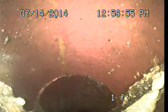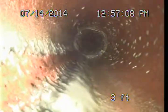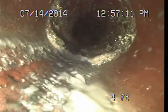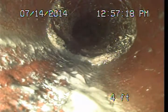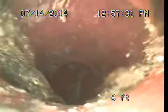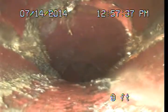Now, these clay pipe materials, they're very common for main sewer line systems. And this would also be an original pipe. This was not upgraded when the structure was remodeled. That being said, if a line's in reasonable shape, no reason to start changing it. But it is an older system and does require maintenance. You see we've got root intrusions at some of the joints or connections in this older clay pipe. That's pretty common in the older clay pipes, and normally root intrusions at the joint areas we're suggesting can be maintained. Regular sewer line cleanings are recommended, because when they're left unmaintained for extended periods, they can create blockages in a system, also potentially damage a pipe.